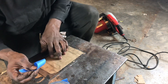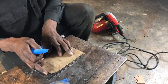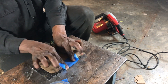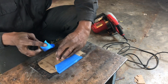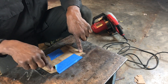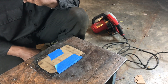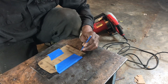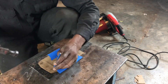I'm going to tape down the template so it doesn't move, leaving some space so it can slide back and forth. When I slot it, there'll be about an inch-long slots. I'll start the holes here, then there'll be another hole here, and this will be slotted out along here. Let's punch some indentations directly in the center of these.